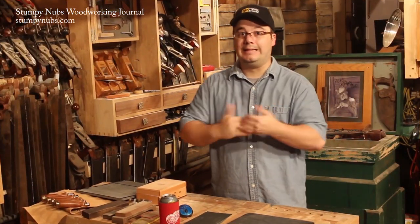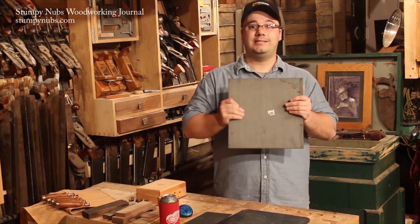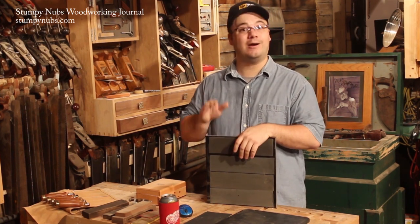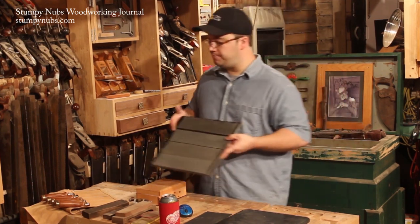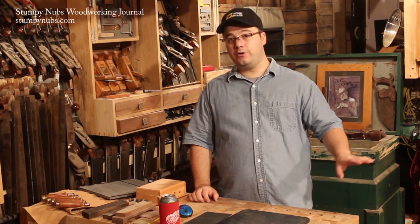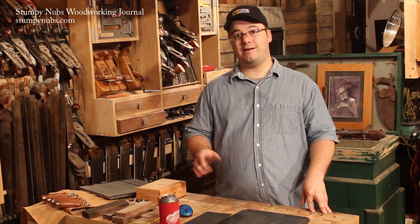Now let's talk plates. The most useful are the flat surfaces you attach your sandpaper to for sharpening. Surface plates made of granite from woodworking suppliers can cost a lot, but you can get a granite floor tile for about five bucks, and if you grab a straight edge to check them before you buy, you can easily find one that's super flat. If you're really on a budget, the cheapest solution is to put the paper right on your cast iron table saw or joiner bed. The downside is the sharpening can be pretty messy — adhesive sprays, water for lubrication — you don't want that stuff on your table saw.